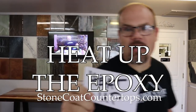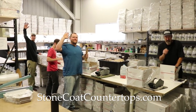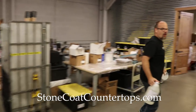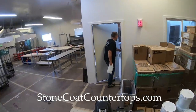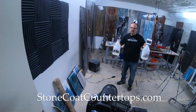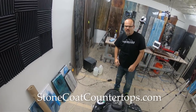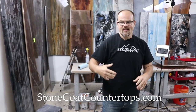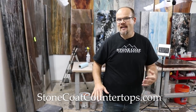First thing is heat your epoxy up. So when we're going to work with any epoxy, whether it's a two gallon kit or a half gallon, we simply put it in front of a radiant heater. We'll turn that on and we let it heat up for about a half an hour just so it's nice and liquid and it's consistent. That's key — consistency. You want to work with the same temperatures all the time, whether it's summer or winter. So if you can get it nice and warm, it really flows and performs best.